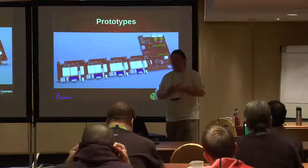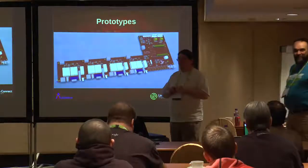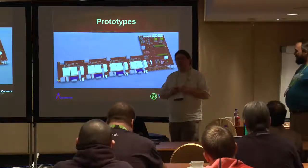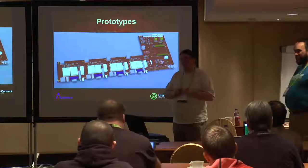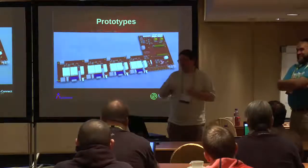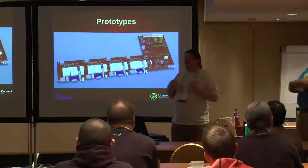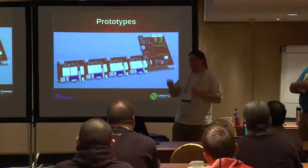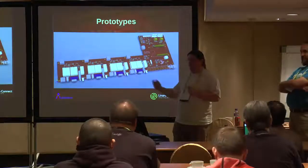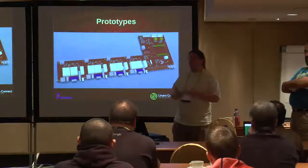I'm looking at the i.MX53s here, where version 1s, you power them up, and they sit there and do nothing until you hit power. Great if you're on automated testing. Somebody has to run into the machine room, hit the power switch, walk out again. So yes, you're probably going to have to modify your EUTs to put a cable across the switch, and that just plugs in.